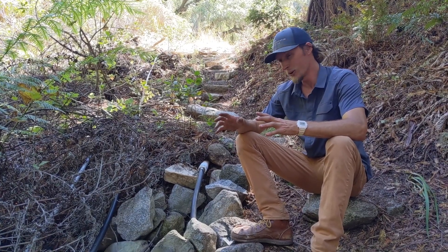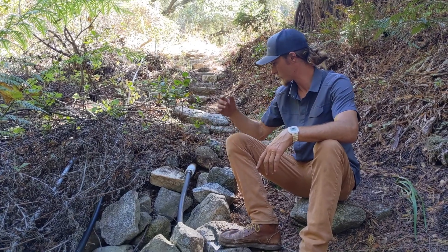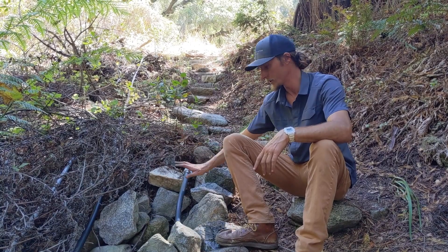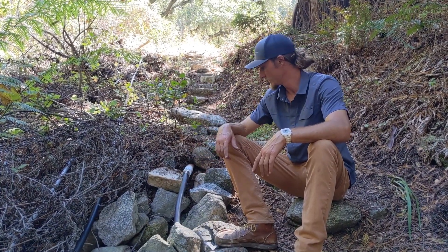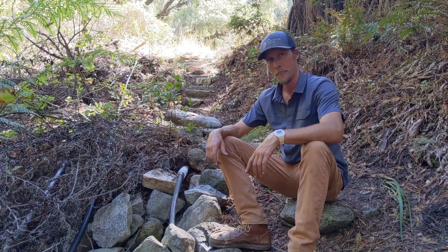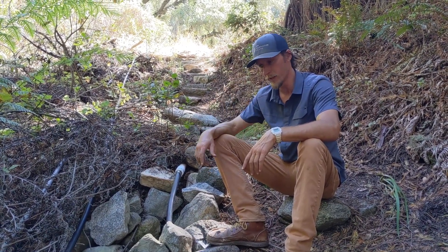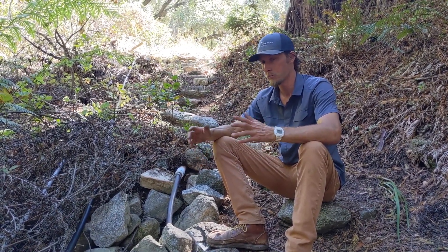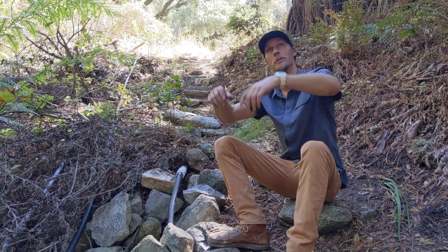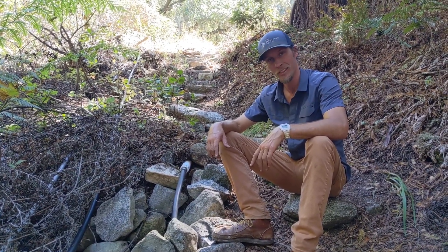As I was being told this and enjoying a cold drink on a hot day, I was led over here and saw this water coming out of the hillside, so figured this would be a good place to start. They've got water — late August, three quarters of a gallon a minute flowing right out, which is right around a thousand gallons a day. For most single-family residences, that should be plenty, with some to spare for these beautiful redwoods downslope.